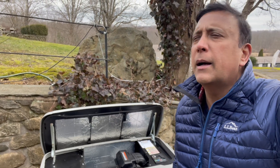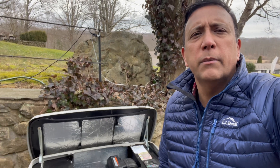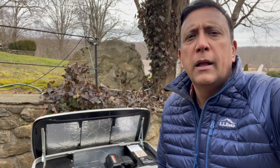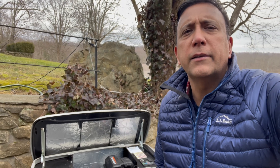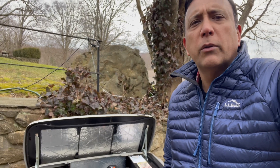Specifically, we are now connecting the 1800 or so generators we service to the fleet system, which allows us to remotely monitor your machine, clear a red light remotely, know when you have a red light, change your exercise time, upgrade your firmware, and do all kinds of things. It's an excellent way for us to know you have a problem before you even know you have a problem. We'll know your machine isn't going to work before you do, and most likely 90% of the time we can simply correct it remotely from the office.